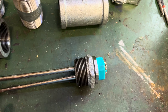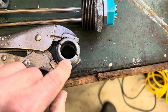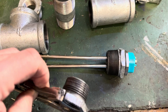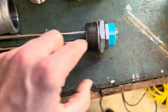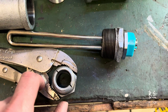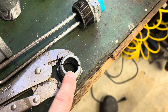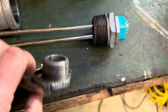To do that, I made my own little cheap thread chase. All you need to do is take a reducer — this is a one inch NPT, national pipe taper outside — and you take your grinder and just cut a slit in there. As you thread this fitting inside of that one, the cut edge acts as a thread chase and it will actually clean up threads really well. So rather than spending 50, 60, 70, 100 dollars on a straight thread tap, you can get away with just using this with a little bit of oil to help lubricate the cutting, and it works really well.